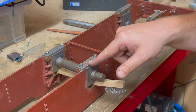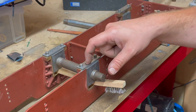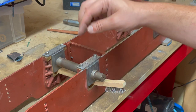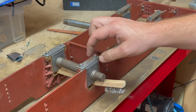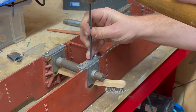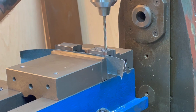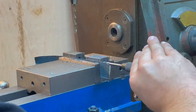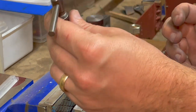The next step is to drill and tap the axle boxes for the spring pins. Curly Lawrence suggests bolting the hornstay into place and then using a piece of wood underneath the axle box, get it right up against the hornstay, and then simply transfer punching through. So I'm just going to tap these like I've tapped everything else, just by hand.